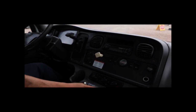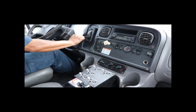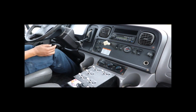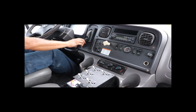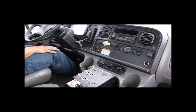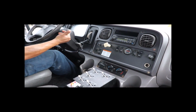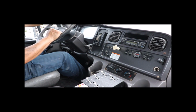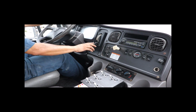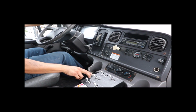Now, if we're going to go mobile, we're going to have to shift the transmission into the low gear, which will be like the first gear. That's how we're going to demonstrate in the video coming up. We want to use the low gear just to get the best performance of the pump and the system, and also to keep the truck from going into a high speed, should I say. So low gear will be for this particular unit in order to get the best results, and we'll see that on the next video.